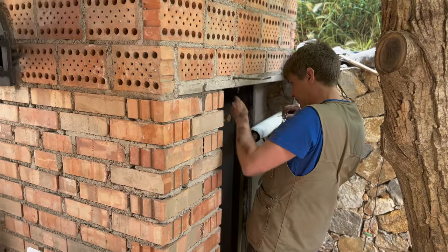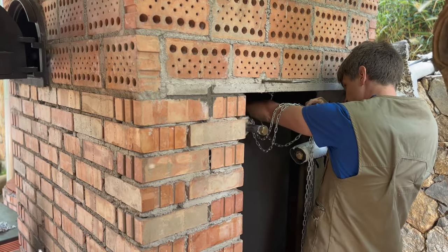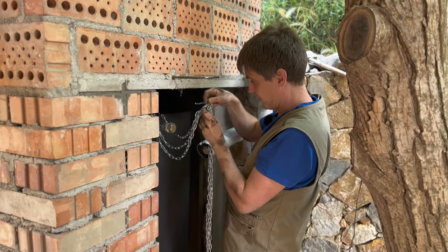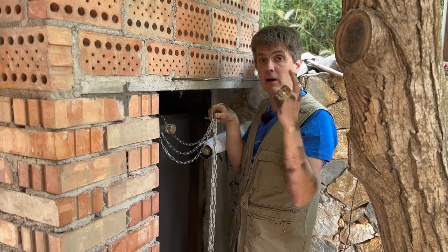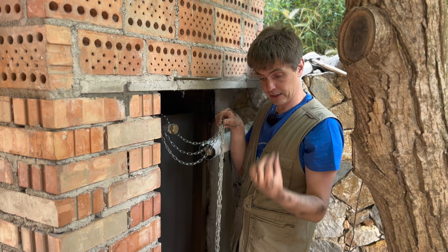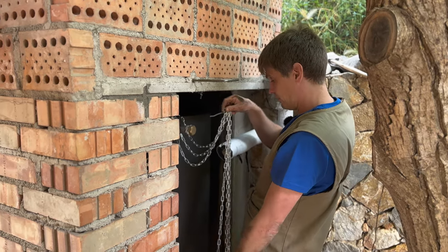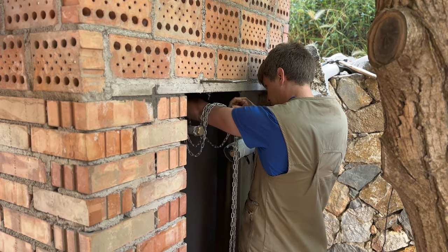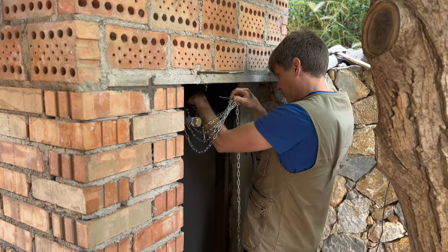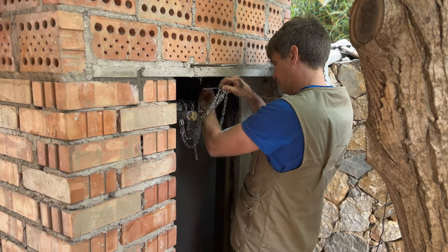You're putting the metal chain in to slow down the airflow — but not just slow it down, that's the important thing. The airflow will slow down a bit, but more importantly it will be turbulent — a chaotic flow where it's not just flowing cleanly straight down the tube. That means more of the air ends up in contact with the inside of the tube, which means more of the heat gets transferred to the water in the sleeve on the outside.